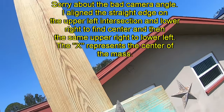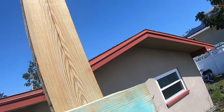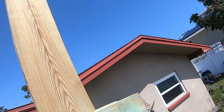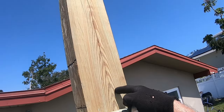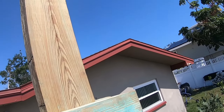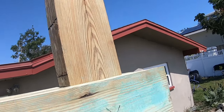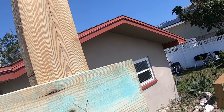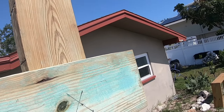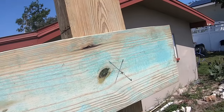And caddy corner this way. And of course, I'm going to have to take that screw out. So the plan is, the thickness of this plus these 2 beams is 7 inches. So I have a pilot drill that I'll use to poke a small hole all the way through. And then I have a 5/8 drill, which is not so long. Although, I think I might have a spade drill. Well, whatever. So that's what I'm going to do.